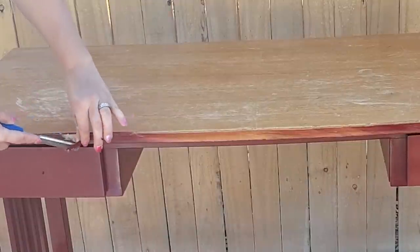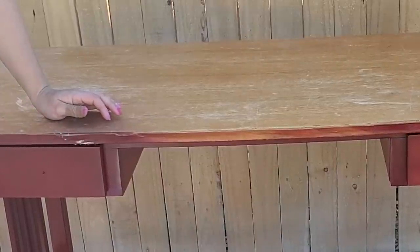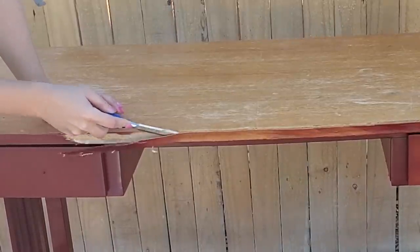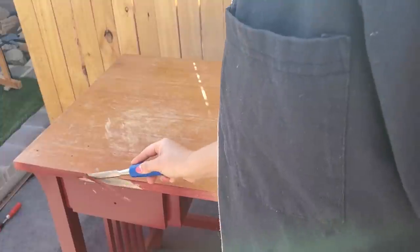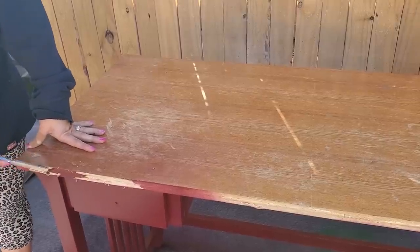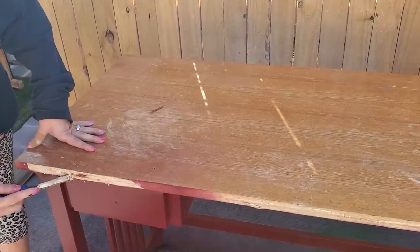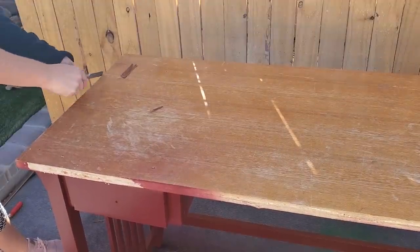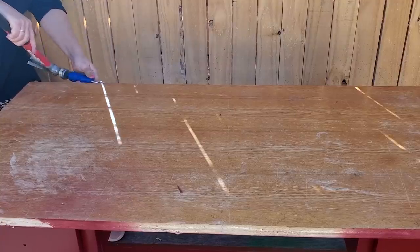For the top, there's really no going back on this piece — if you painted it you would still see all the issues underneath as far as texture is concerned. This faux wood edge just had to go; there's no gluing it back on or smoothing it out with a sander, so I just used a chisel and chiseled it all off the edge so that I had a flat surface. After finishing that, I sanded the top with 220 grit — I just didn't get that on camera — and smoothed it as much as I could. Once that was done, I decided to cover the top with a peel and stick countertop material.